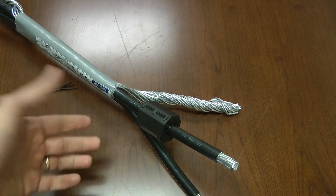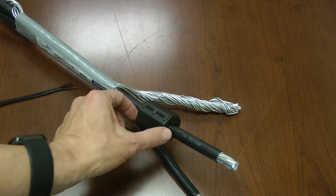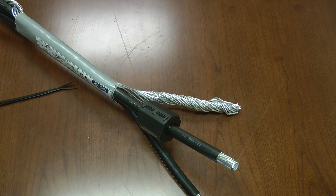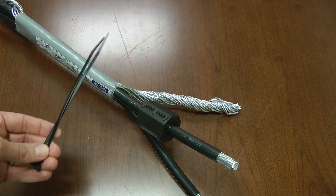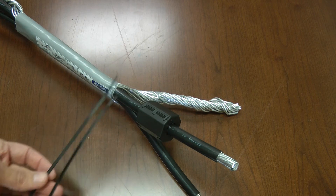If for some reason you have a 100 amp feed and you have smaller wire than four-aught wire, it might be a little bit loose. You can either find a stable place for it to rest in the circuit breaker box, or you can simply take a couple of zip ties and put a zip tie above and below the ferrite around the wire to hold it in place.